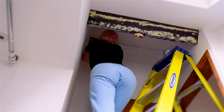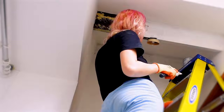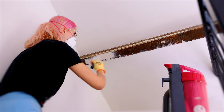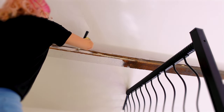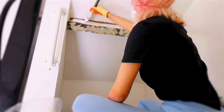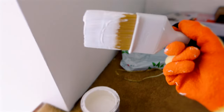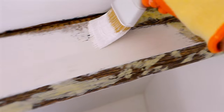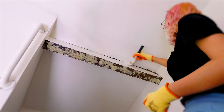Of course this was never the plan. The wood needs to be treated and restored because there's a bit of rot and damage from wood boring beetles — that means there's huge splits and hundreds of tiny holes. But in order to use treatment on the wood you need to strip it back to bare wood. At the beginning we thought it was varnish on the wood but because nothing is removing this colour at all, it appears to be a stain. Stains are difficult to remove — sanding did a little bit and the paint stripper did nothing. It kind of seeps into the wood rather than sitting on top. There doesn't seem to be any kind of varnish or sealant on top of the stain — since it's not glossy it doesn't feel like there's any kind of coating on it. So we went straight in with treatment and are hoping that the majority of the treatment will reach the wood.